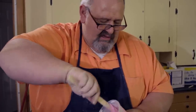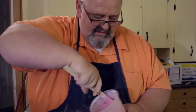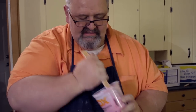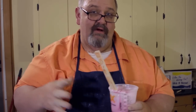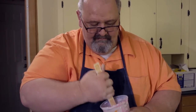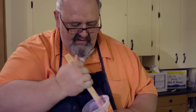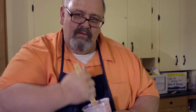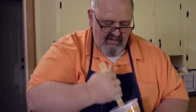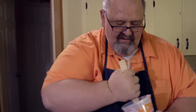When you're choosing the silicone you're going to use, it's really important that first you make sure it's not going to react with your clay. That's the number one thing. And second, that the material isn't going to take forever to cure, because you don't want to pour it on, and then have to continually pull it back up over the piece and have it drain back down again. So it's nice to have a silicone that will start to cure within about 20 minutes. This particular silicone has a curative in it that speeds it up a little bit, so I don't have to wait for the long curing process.